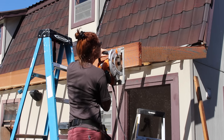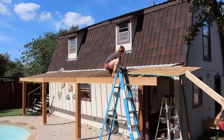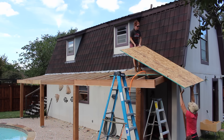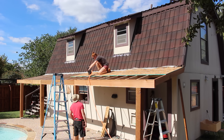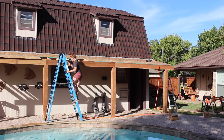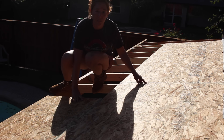With the rake in place, I could cut the 2x8 header to the exact length needed. Framing is done — on to the decking. At this point I had to call in some help to get the full sheets up there, and it became much easier after getting the very first sheet down. I would make sure each sheet fell on the center of a rafter and used my pneumatic nailer to nail it into position. I first did all the full sheets along the back, then came back and did all the partial pieces up front. When decking, you want to stagger your joints, so I intentionally cut one sheet a little shorter so it would not be on the same seam as the adjacent one.